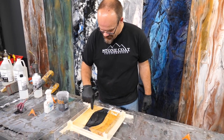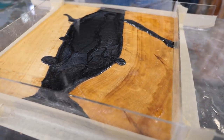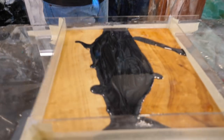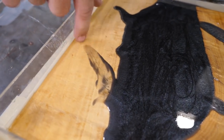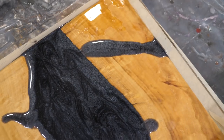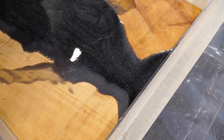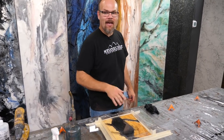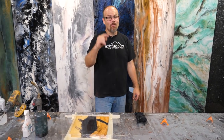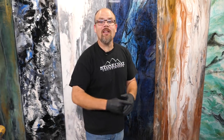I think I'm going to pour some of this excess in these cracks here too, just to fill those in, and then we'll sand it all flush. I'm going to do the paint pyramid mix-up — use a paint pyramid and stir it up a little to give it a cool design. We're learning all the steps to how to do this at scale and create any size table or conference table using wood and epoxy. Even though I have a little air bubble coming up here — that means my edge wasn't perfectly sealed — I know I'm going to come back and do clear over this. A lot of those turn out to be happy accidents.